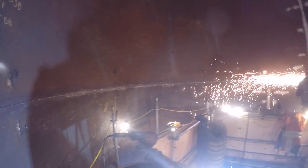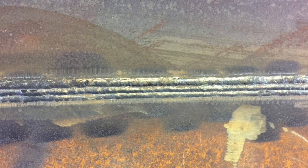Here's my finished cap — it's a four-pass cap. You can see it's not perfect; it's a little wavy in spots with a few stop-and-starts in the middle, but overall it came out very nice. Here's a shot of me running down the whole thing, wire wheeled up. This is one of the last sections I welded and you can see the weld is significantly better — bang on right there. Over time you get practice and you can just kill it. I'd say that's a very nice horizontal flux core field weld, definitely.